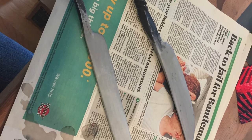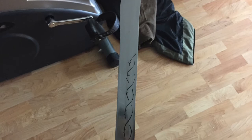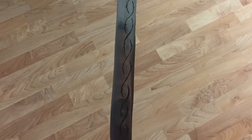The polished blade was then covered in wax and the design was carved out, making sure to expose the metal underneath. The blade was then dipped in ferric chloride for 40 minutes. After the time had elapsed, the wax was removed using boiling water, revealing the etched pattern on the blade.